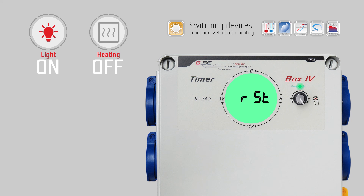Turn right for P12: factory settings — push the encoder and turn to yes, then push again to confirm; or select no and push to return without resetting. Turn right to go to P13: end, and push the encoder to confirm. The timer box initializes with the new settings.